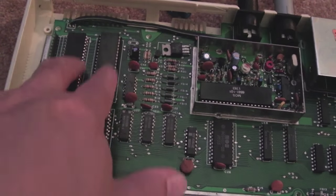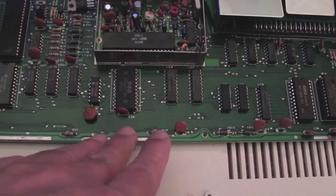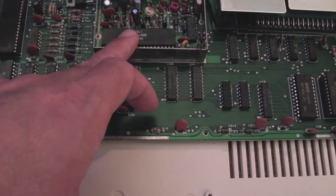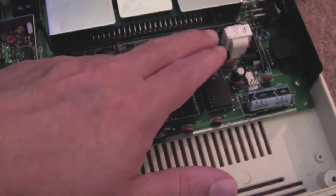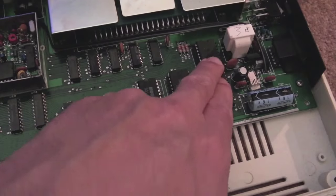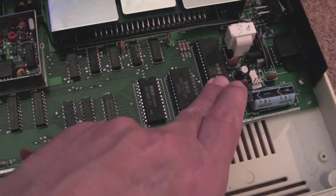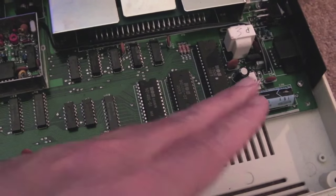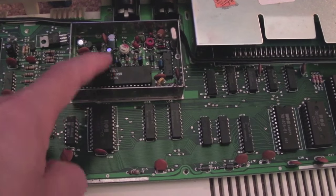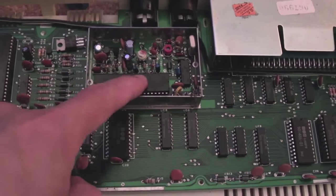You've got 6522s here, whereas in the C64 you've got the 6526s, which sit in the same place right next to the keyboard connector. It's all very similar in architecture. The difference really between the C64 and the Vic-20, if you exclude the minor differences in the CPU — which really is minor, it's IO support logic built onto the chip — then you're left with the VIC chip itself. You've got a VIC-II on a Commodore 64, so it's more capable in terms of graphics. And on the C64 you've got the SID, whereas on this system the sound is generated on the VIC chip itself.